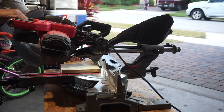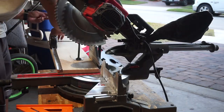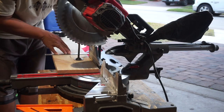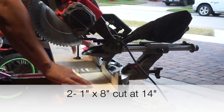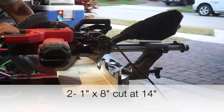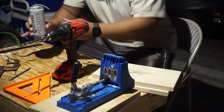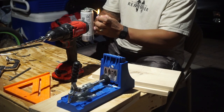I start every fresh board I cut with what I call the sacrificial cut — just trims off the slightest bit on the edge to make sure it's square compared to the fence and blade of the saw. Then I make my two cuts on the same board — it's a one-by-eight. I cut two 14-inch boards; those will be married together at the long edge using pocket holes.